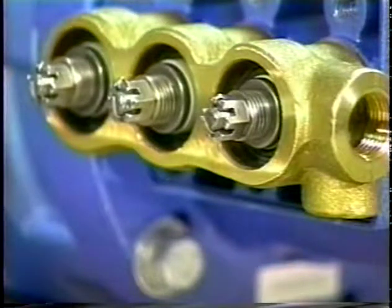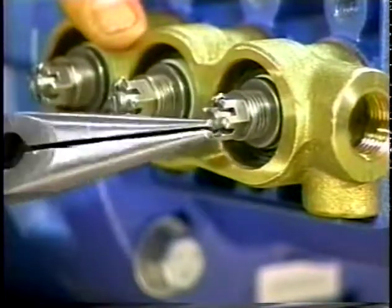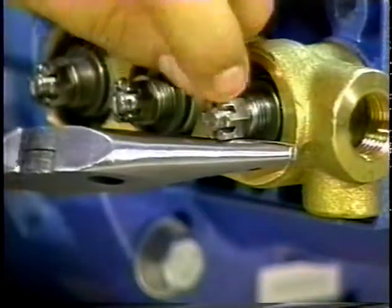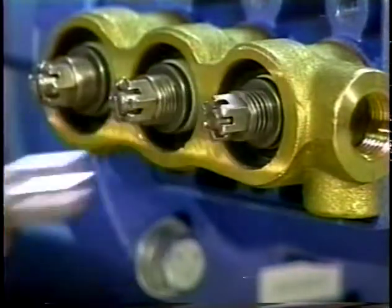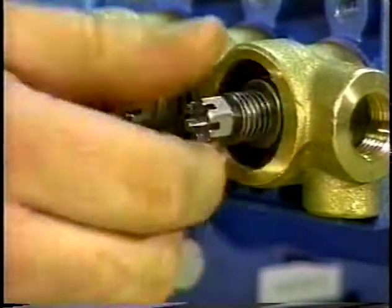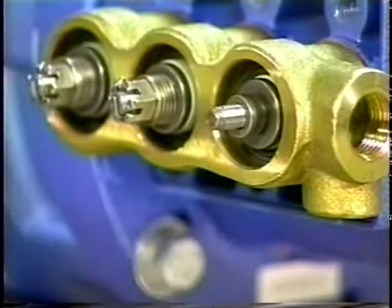To service the seals, remove the inlet valve assembly from the exposed plunger rod. With a needle-nose pliers, straighten out the cotter pin and remove from the nut. Note, on the X versions, there is no cotter pin. Then, use a 10-millimeter hex tool to loosen and remove the nut. By hand or with the pliers, remove the washer, spring, spacer, and inlet valve.